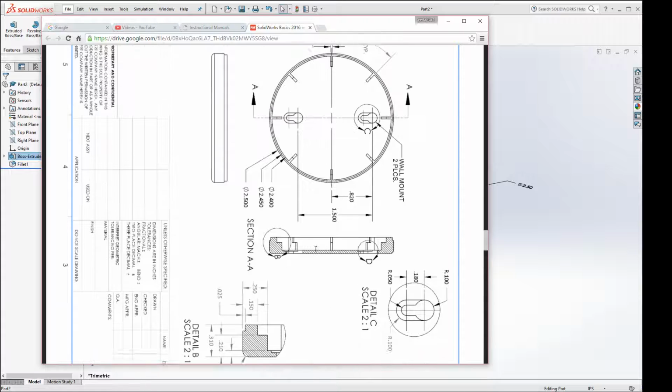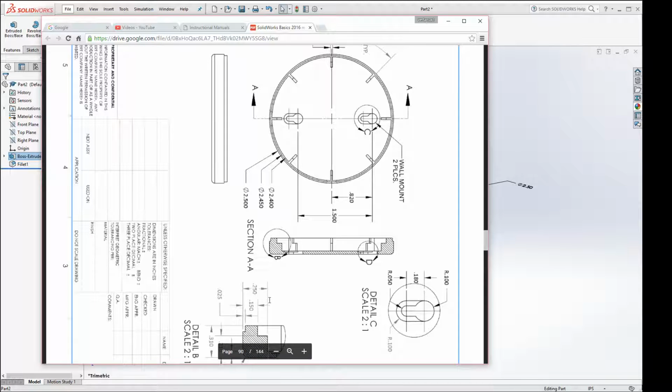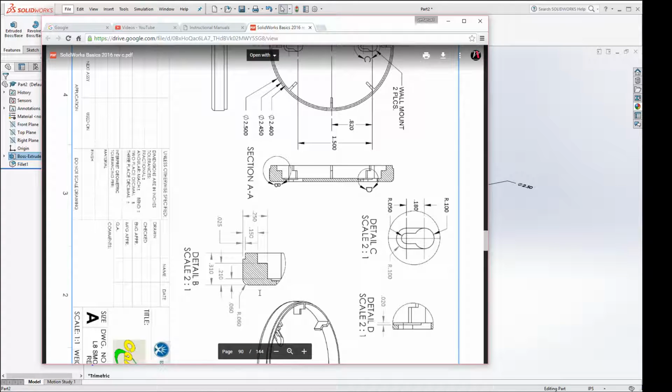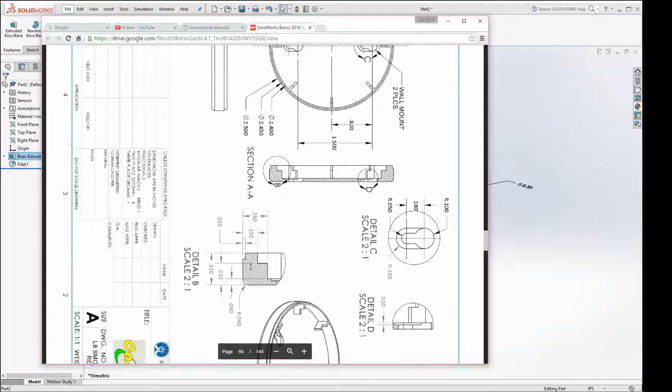No, actually in this case this is not, because we have a lip on here. You don't want to shell it because it's varying wall thicknesses. In the other class, the advanced class, we go into multiple thickness shelling, which is pretty easy, but I'm not going to do it in this case. Just going to model it up as is. All right, so what we see here is that the floor thickness is 60 thousandths, but the wall varies a little bit here.